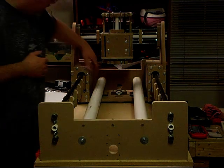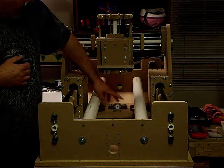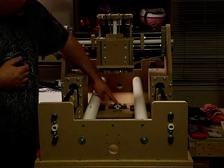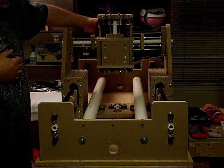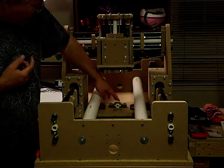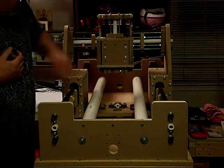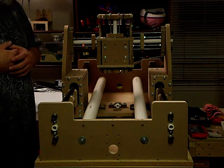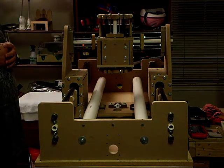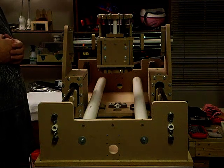These are the same style of lead nuts that I have on the previous machine. This lead nut carrier is cut out of Trex decking — I think it is one inch wide — and I have two nuts that I manufactured on each one of these lead nuts. There is one lead nut here, one on the back of the Y carriage, and one on the back of the Z carriage, so there are three of them. This is cut from half-inch cutting board — I cut it and tapped it, trying to make the spacing the same as the dumpster CNC nut, so if I decide to use those I can order them with cut-off flanges and use them. It worked really well on my previous machine, and it is quite a money-saving feature.